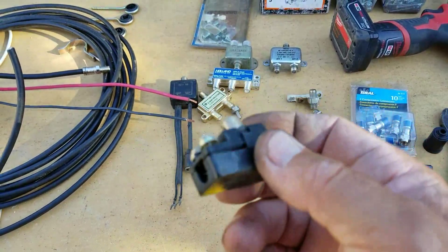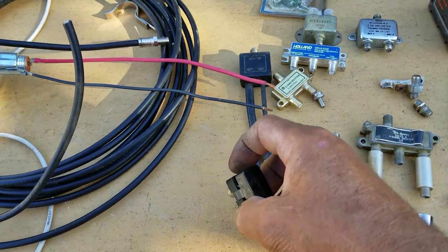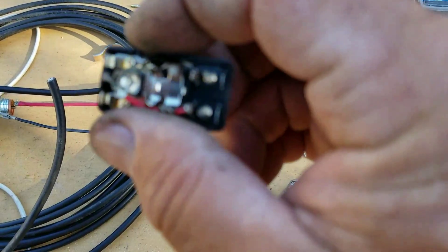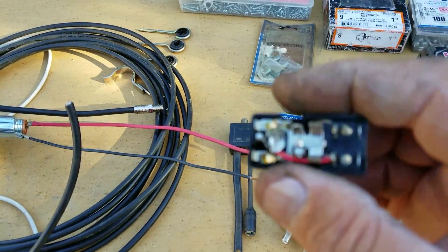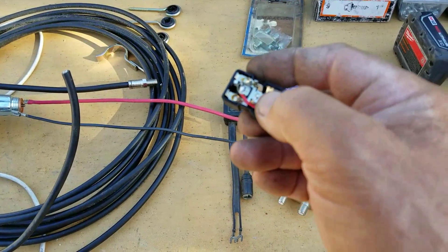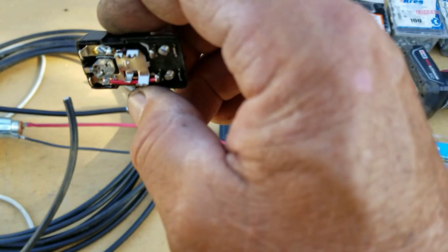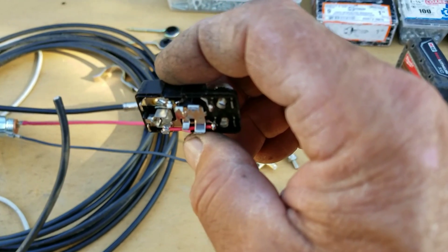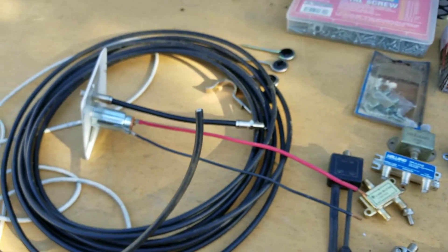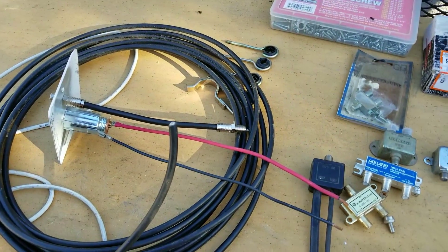Here's another little thing — this is a balun, a real old interior balun. If you look inside, right underneath this metal plate there's a little ring with wires wrapped around it — that's primary and secondary — so that gives you your 75-to-300-ohm transformation right there. It says on the back it's interior use only and it's plug-on type, so not really ideal for outdoor use.